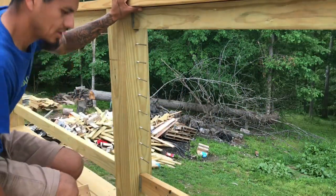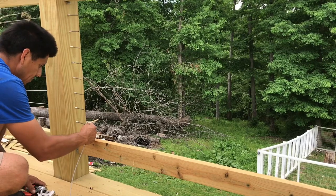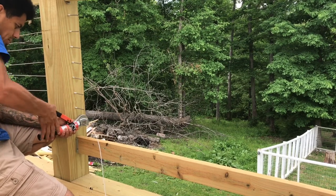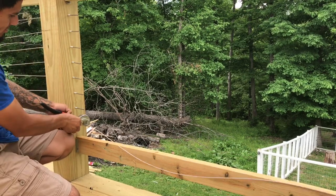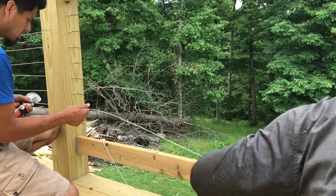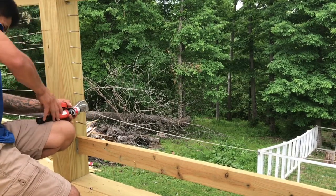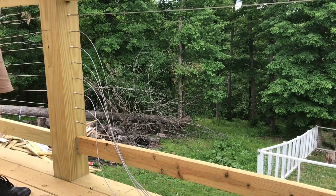Now that they're on, it's time to install our wire. With the wire we have this press that we're going to use — it's up to five tons; I'll leave the link in the description. It just tightens that screw and the anchor, and then the wire is connected. On the other side we just cut it with the help of another person, and they hand me the other end so we can do the second one. That's how we do all of them — one whole section first and then the other end.